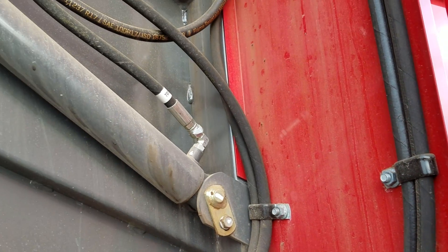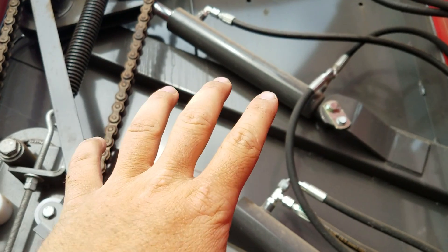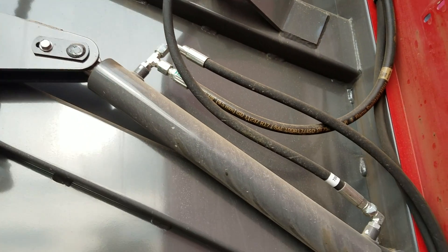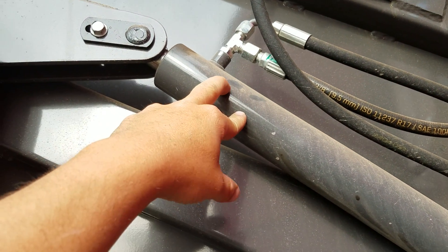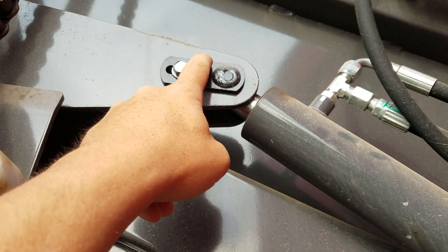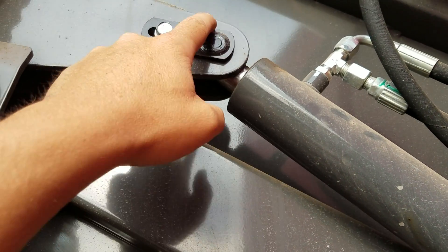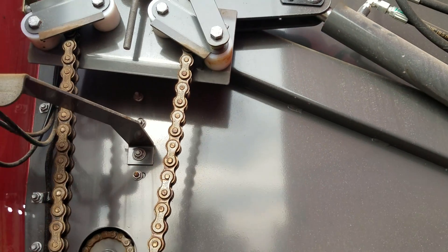There are three grease points here and there'll be a grease point bank back there. I never liked the double-cylinder tension on my old machine — not necessarily because it didn't work, but after a while the seals would go out and you'd always lose tension. We'll see how that is. John Deere uses pretty much the same style pin and I don't like that pin at all, but it seems like that's what everyone's going to.